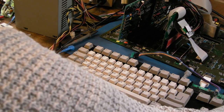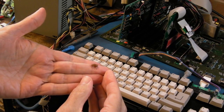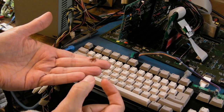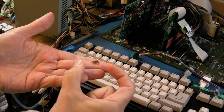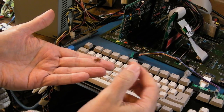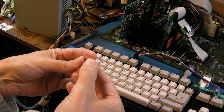Yeah, this, we use the term crystal, but you know what, it's actually a resonator. It's not an oscillator. So a crystal oscillator, they're usually 4 pins, it's usually like a 14 pin package, one of those rectangular crystals there, and that has power and ground, and it's probably got the capacitors and things, and maybe even a transistor or something in there as well. An inverter, that is.